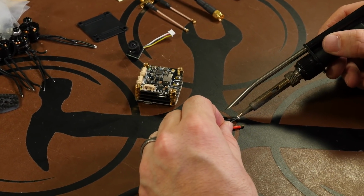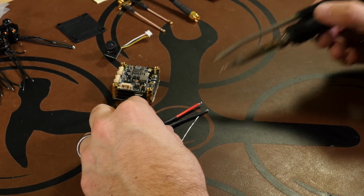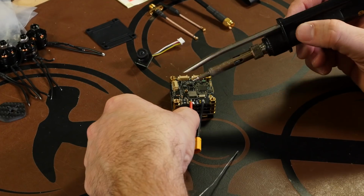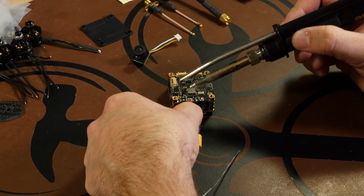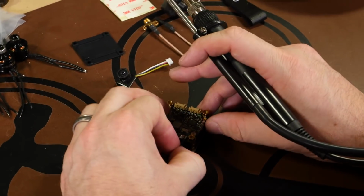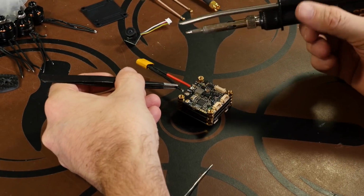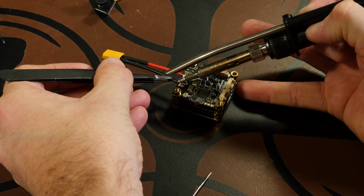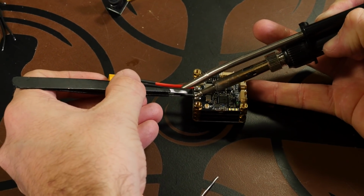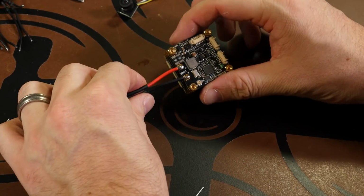Just do a little bit of tin on our wires here. And we'll get them ready to go. Positive to positive, and negative to negative. Now if you haven't soldered before, I definitely suggest you take a little bit of time and practice before you do anything on something that you don't want to break. And we'll have links in the description for soldering videos if you need to study up. And that's it for that. So our battery connector is on.